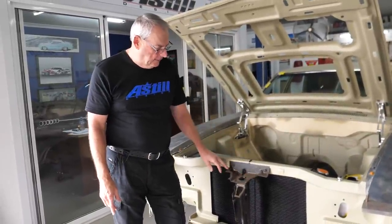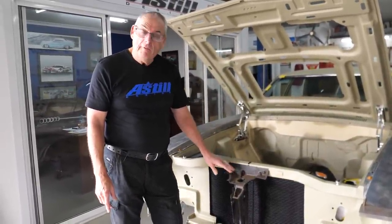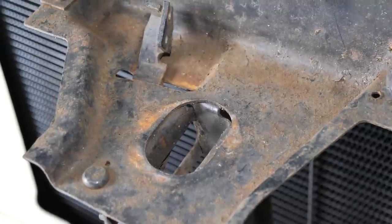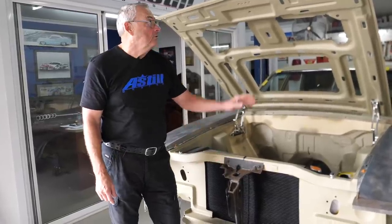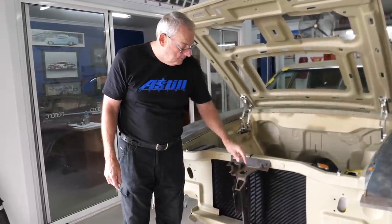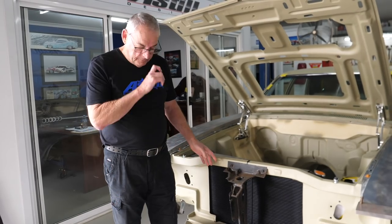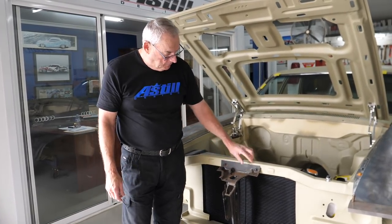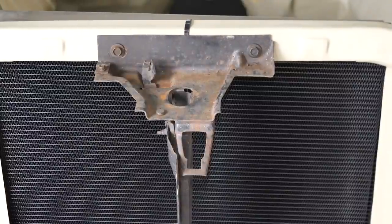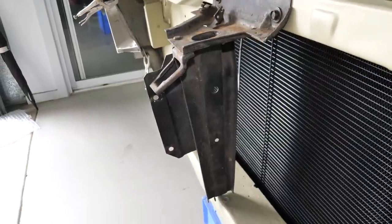Now that we're forward, the next thing is the lock plate. This is the original XC one - I was humming and harring whether to get rid of it and do something trendy, but as you can tell with the hours in this car it just adds up and you never get there. So I'm going to run with the original pin and safety catch, which means I need this area and this area to be operative and we can run the standard cable. What I'm looking to do is take the top off this plate and make a new one out of some two-mil to make it look a bit more symmetrical and tidier - that way it'll be a few hours work instead of redesigning the whole front end, and it'll be on factory mounts for safety.